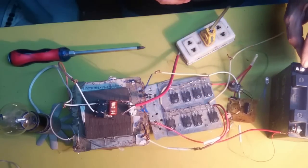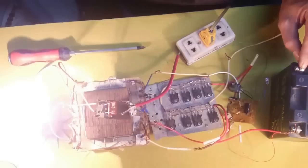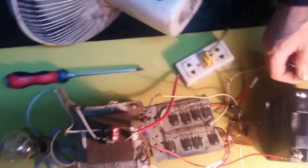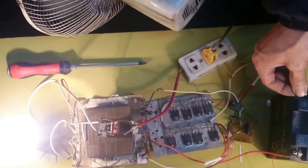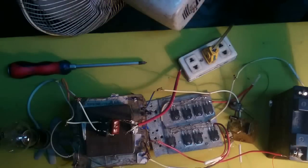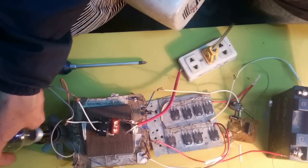Using this IC4047 for driving, it is quite sensitive and smooth. If you only use light bulbs it will be very quiet with little buzzing noise. But if you connect a fan, you need to calibrate the variable resistor properly. The fan must be in good condition and the rotor must be centered — not off-center at all — for the fan to spin properly. Of course it won't spin as well as grid power because this is driven at a square wave oscillation of 50Hz, not a sine wave.